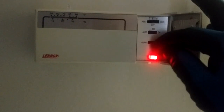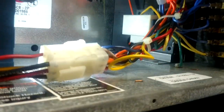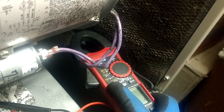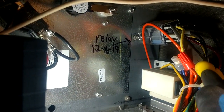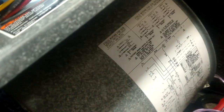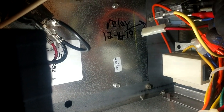Here's what we're going to do - we're going to kill our power and switch our meter back to continuity, as Ted calls it, the dummy beeper. I'm going to pull these wires off over here. Again, this is our fan with electric heat, so these terminals are normally closed top to bottom. Let's check our continuity - our meter is in continuity and we've got tone.